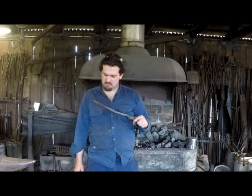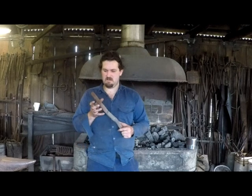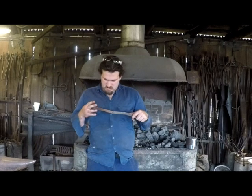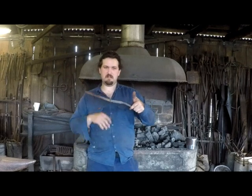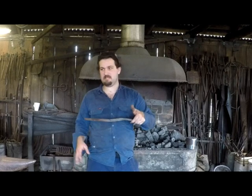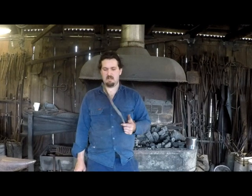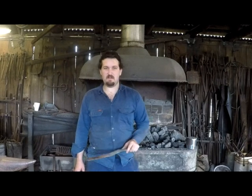I'm not derusting it because the fire will take away the rust, and I'm not grinding off the teeth because I've seen people use various rasps and files and leave the teeth on to give them more grip when they're forge welding. So I'm just going to fold this into a W after I've chiseled these grooves in. I'm going to fold it into a W, fill the inside with borax, which I did do on the last one because I put the saw blades in. But I'll close it down onto some borax and then start heating it up to get it up to a forge welding temperature. And yeah, we'll see where we go from there. And then I'll have to figure out some way of combining the 2 billets and folding them together. I'll cross that bridge when I get to it.